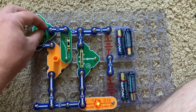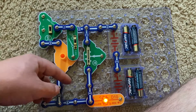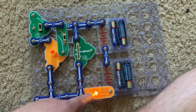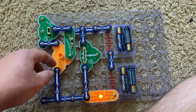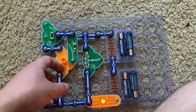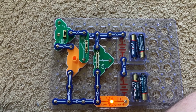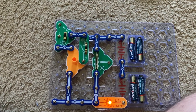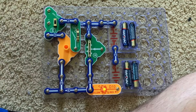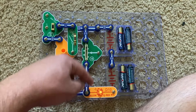Yet when I move the switcher to the C position, the bi-color LED reaches full brightness, because now there is just a 47-ohm resistor for the electricity to flow through. That's all there is limiting the current. Electricity will always take the easiest path through a circuit where there's less resistance. But if I close these paths, the LED becomes dimmer — this is the only path that the electricity can flow through now.